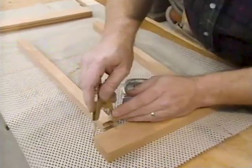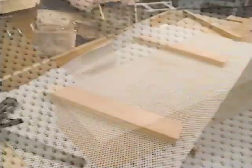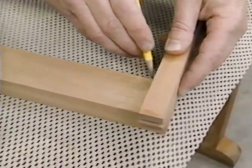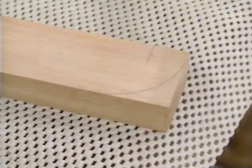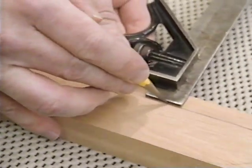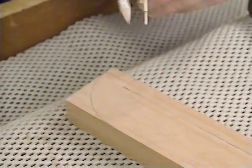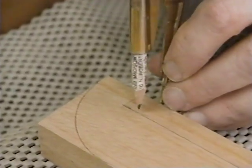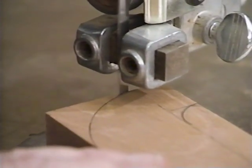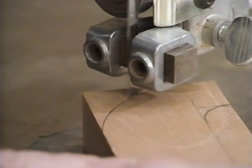I've set my compass for an inch and three-quarter radius for the outside corners. Let's do the layout for the inside cuts. Using the front or back piece flush to the end, I put a mark on the inside. Then using a combination square set at a half inch, I'll scribe a line point to point, and then with the compass set at a half inch, mark the inside radius. I'll make the cuts over at the bandsaw, being sure to leave the line, then fine tune them back at the drum sander.